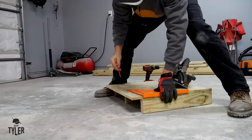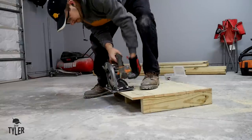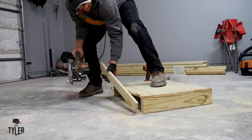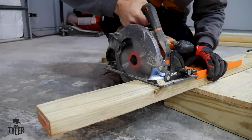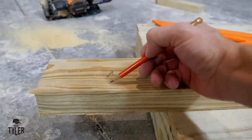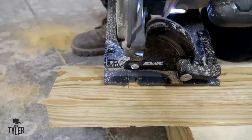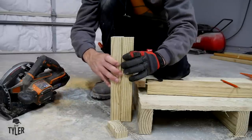There's one piece that is going to be overhanging the back, and we're going to cut that with the circular saw — whereas in the shop I would use the table saw for something like this. To make it easier to handle I screwed it down first, then made sure the depth of my circular saw wasn't cutting too deep so I wouldn't hit those 2x4s. I struck a line and cut it using the base itself to hold everything together, keeping my fingers safe. A quick tip: every time I mark things out with a tape measure I strike a line and draw an arrow on which side I want the blade. If you look at your circular saw you'll notice a notch up front indicating the blade — line up that notch on the right side and you'll get perfectly flush cuts every time using this speed square method.